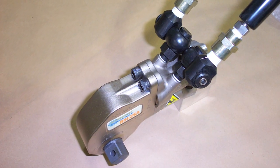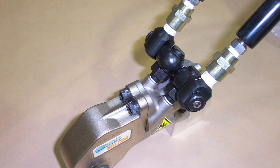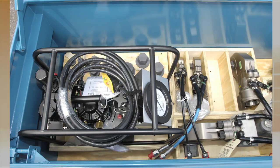The power head has a standard 1.5 inch flexible whip hose with optional swivel heads, 360 degree movement of reaction arms, as well as short, long, and custom reaction options, plus torque wrench kits which can be customized for your exact bolting requirements.